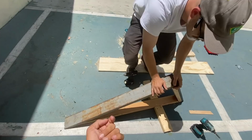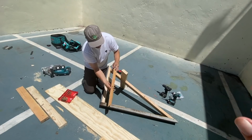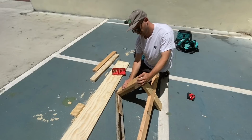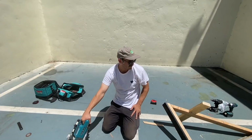What I like about the tutorials that we end up doing is I feel like you try to show as many different techniques throughout the entire design as you possibly can. Like, all these angles and stuff that you're cutting and showing how to get them, I think it's so sick. You probably could rig up a 2x4 and a weird thing on top of it and have it be real crappy. But learning all these little techniques you could also use in other ramps. Very true. Sometimes it's going to be crude and guessworky, and then other times you can bust out some angle finders and squares and get it just perfect. Yeah.